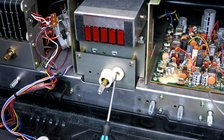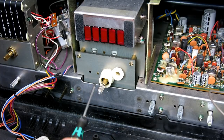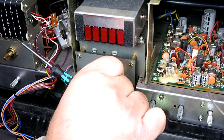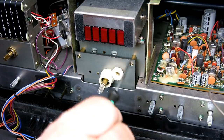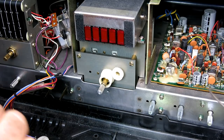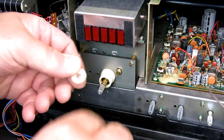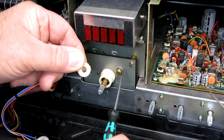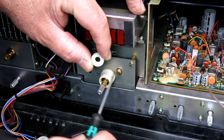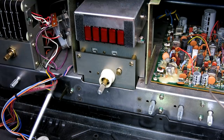Here's our sick gear right here. There's a speed reduction through this knob, and this outer knob through to a potentiometer behind here. I took the gear off, and this gear was originally molded to this shaft. We're not going to be able to do that again, so we're going to make a metal gear to replace this one, and then we have to come up with a way to attach it to the shaft securely.